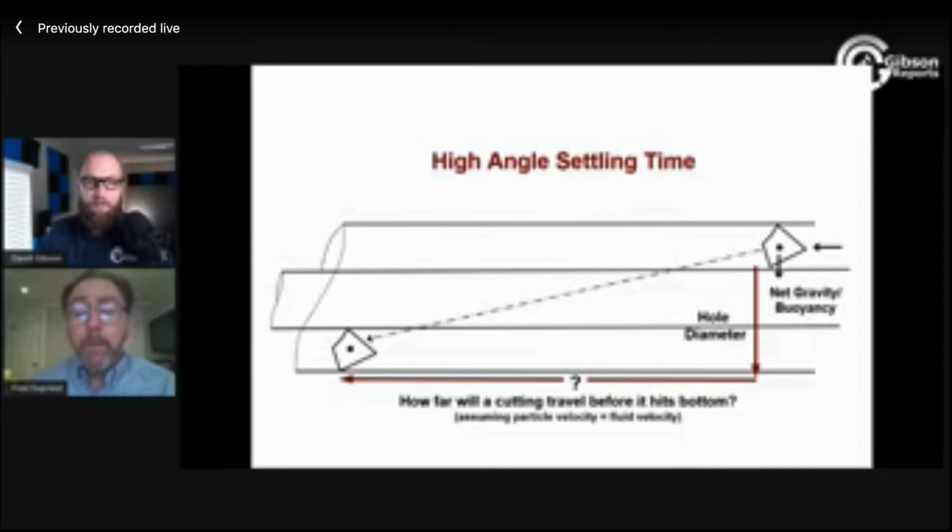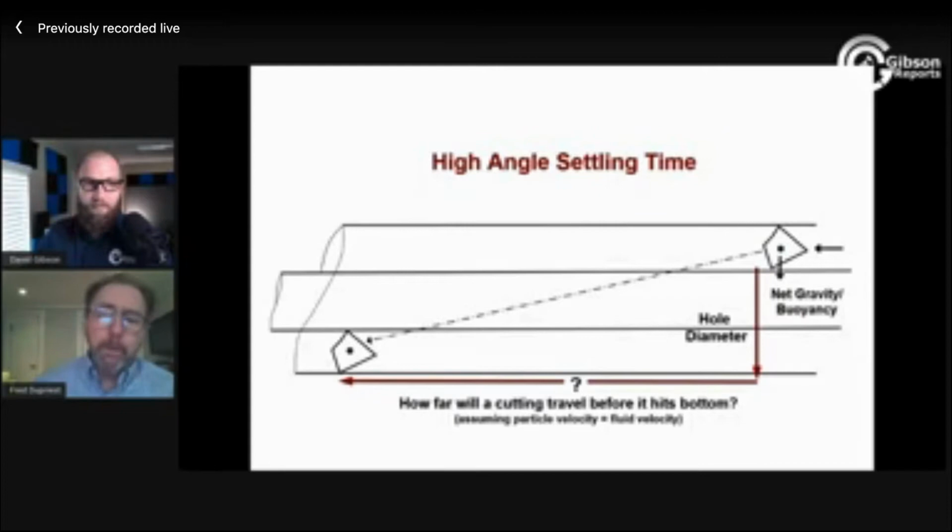The Sprayberry, for example, out in Midland, there is actually a stress regression that happens there in the background rock as you go deeper. Your integrity of the borehole is basically how much stress you have holding it closed. And if you have a stress regression, meaning H min is going down, and your stress holding the hole closed has gotten down to 9.2 pounds per gallon, you're just not going to be able to put more than 9.2 on the hole. So that's a pretty difficult situation.